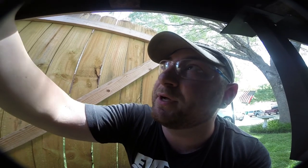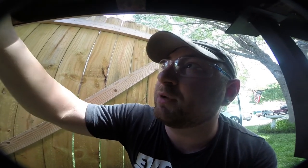We've come across our first problem. If you take a look up here, this right here is a pilot hole I drilled. And that is where the shower has to drain. As you can see, there's this big piece of steel right here. So I'm not really sure how we're going to get through that, but we got to run a piece of PVC through here. And it's about a 2-inch hole. So I'm going to have to remove at least part of this steel beam and find a way to reinforce it, maybe. I don't really know if it's even that big of a deal compared to just cutting it, because there's so much steel here that I don't know that it makes a huge difference.